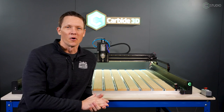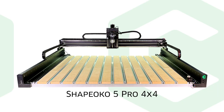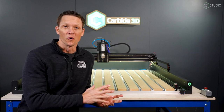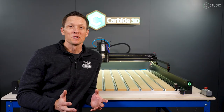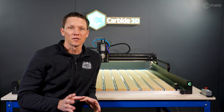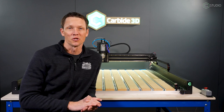Welcome back inside HQ everybody, Kevin Barnett here and today we're talking tables. Whether you just purchased the Shapeoko 5 Pro or you're upgrading from a 3 or a 4 to the new machine, you're going to have to craft a home for it, a place for it to be in your shop. When it comes to a CNC table, I have three main concerns: machine support, mobility, and storage. Let's run through those three categories and give you a bunch of details and ideas on what you might construct for your own personal shop.